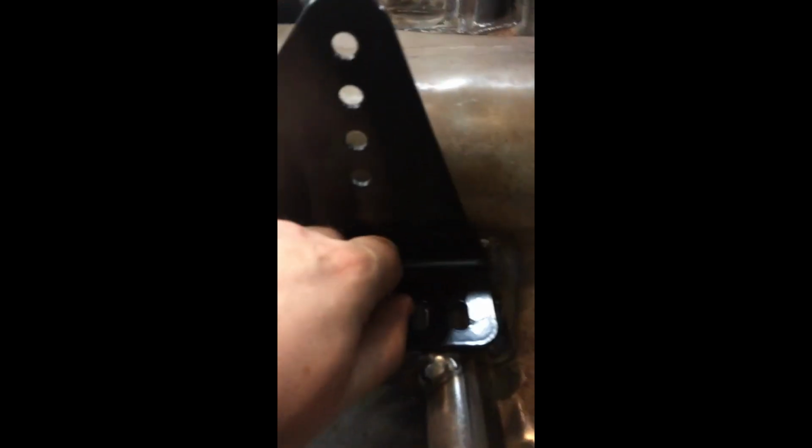There's the front side with the seat mounts in. This side is a little bit different because of the gearbox tunnel. It has to step up quite a bit to mount into there. Puts the seat a little bit higher, but we can live with that. So, seam welded round the back base of the seat stay. There and there, the other side's done. Let's take off this nut.